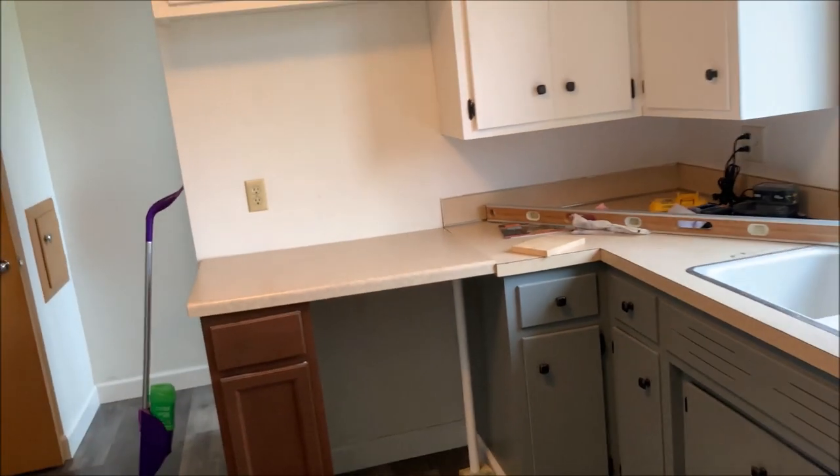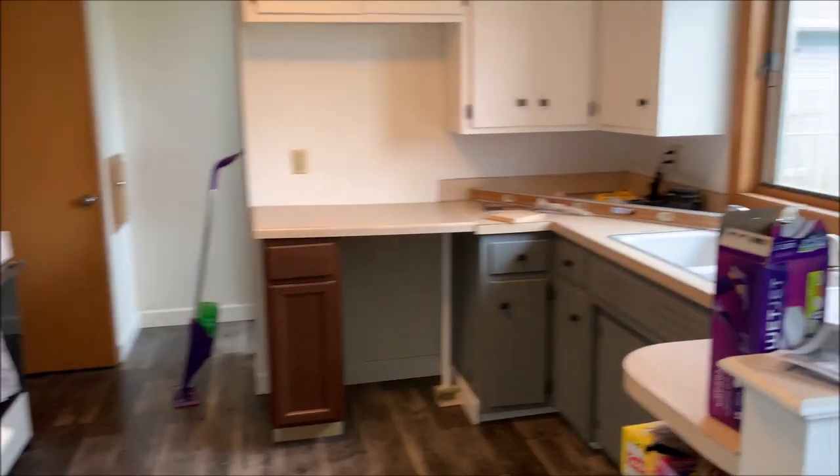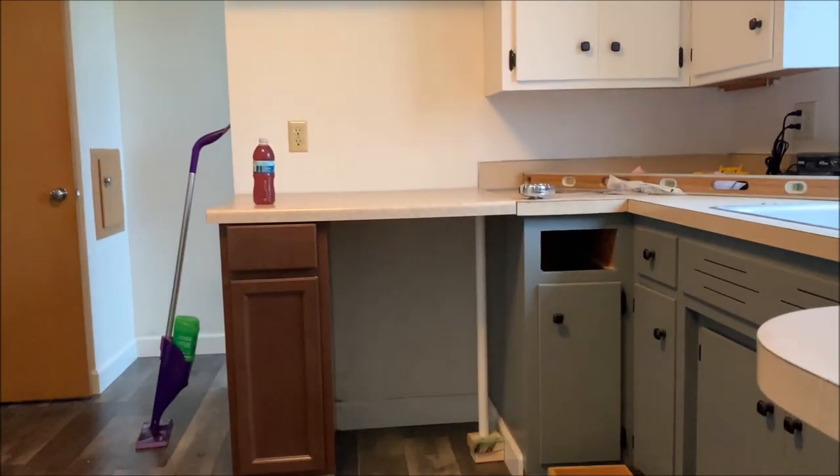You can see it's obviously angled downwards to the right, but look how much more open this kitchen is — it feels like it doubled in size. I'm playing out how I'm going to attach it. I've got a one-by-eight piece just for thickness. Under here that makes it pretty flush. I'm going to take a one-by-four and run it along the length, then run L-brackets underneath. But I noticed this lip — that's what it was sitting on — so I pulled it forward and it dropped down. Maybe I won't need to cut that cabinet down, because that's looking pretty close.